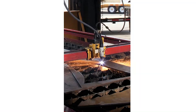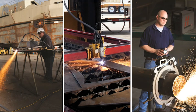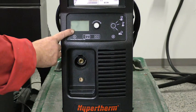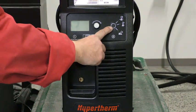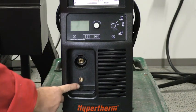These connection types are typically used for cutting tables, track burners, pipe cutters, or other devices that require remote inputs. On the front panel you'll find the main display, a process mode selection switch, fast connect torch connection, and the quick lock work lead receptacle.